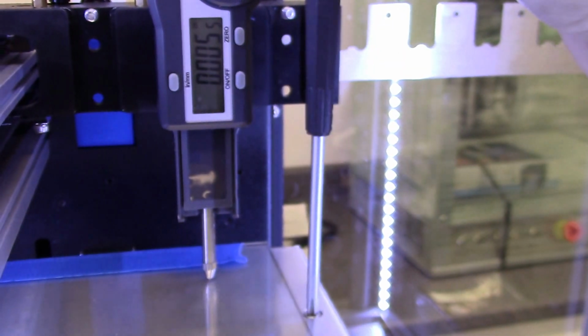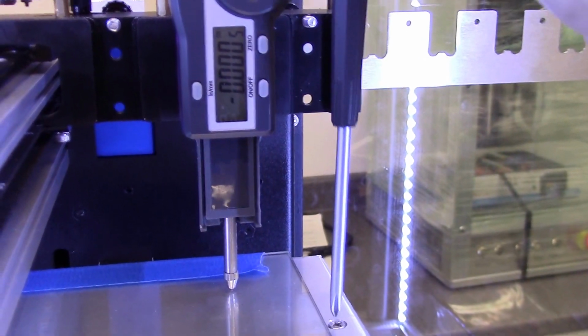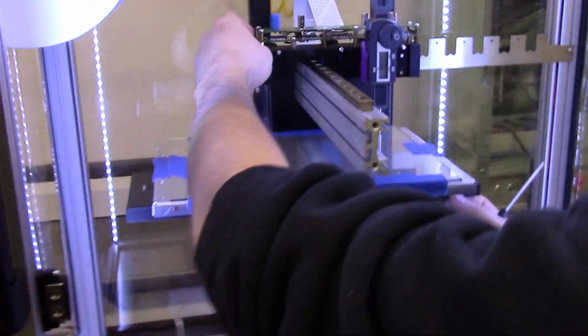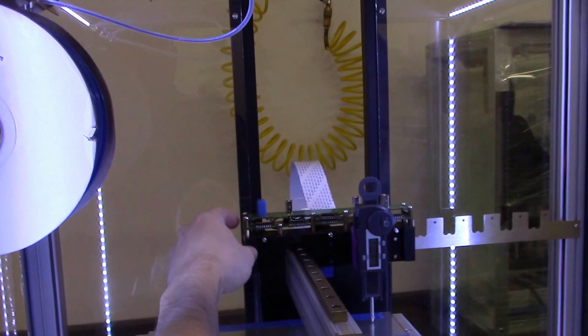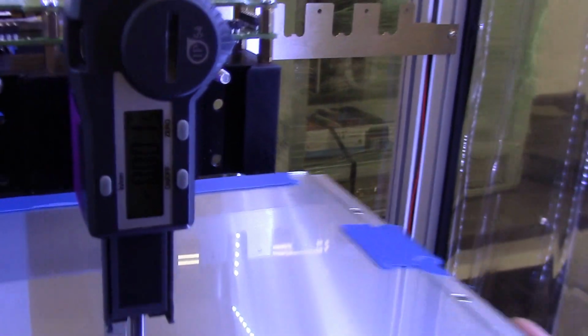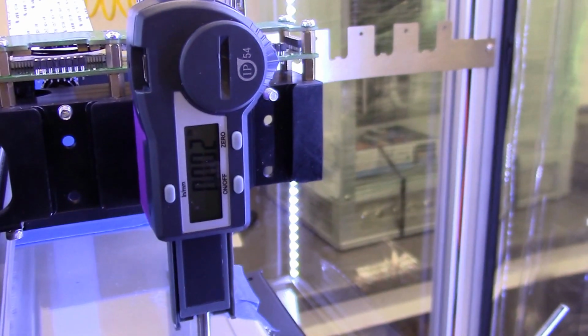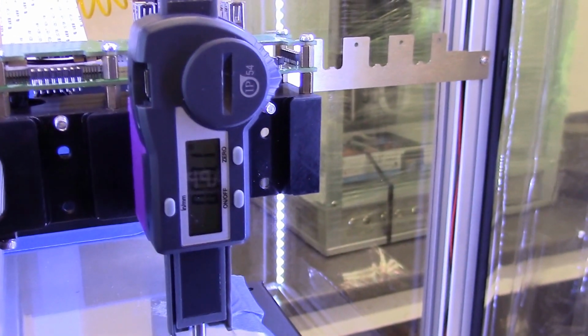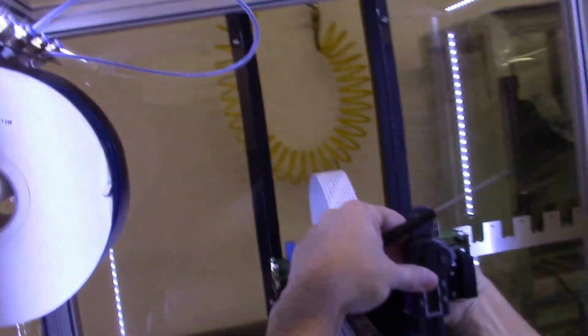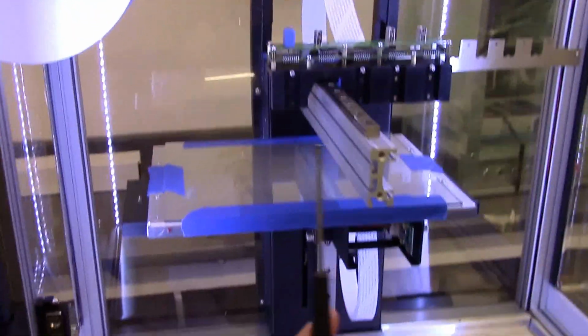And that can be set to thousandths of an inch or millimeters? Yeah. Excellent. And if you're within 1/1000th of an inch, you should be good for most applications. It's better to check it a couple times around to make sure that it's still 0. We set 0 in the center because we're riding on a center post and we're adjusting those 4 corners. Looks good. Okay, now we'll lock.